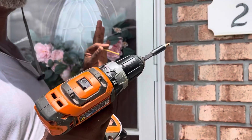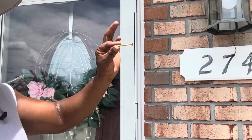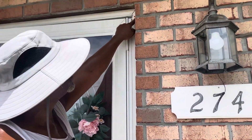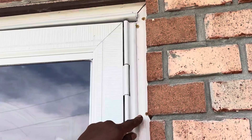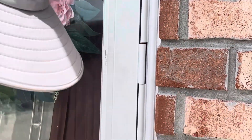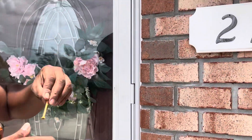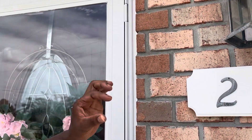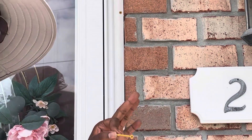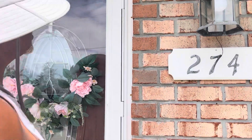So what we did was three-inch structural nails for wood. As you can see, I put two up here at the top and now we're just finishing them off. These go in the structure. I pre-drilled. This little frame here is about an inch thick, so I went with three-inch. It's going to go through the wood and through the structure another two inches. So now that's a solid, strong hold — and that's what you want.